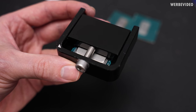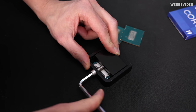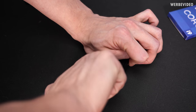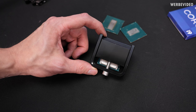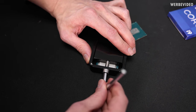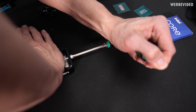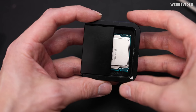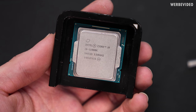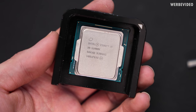The good part is we can still see the components from above — not perfectly but enough to judge if we're touching anything. Just subjectively speaking you need a lot more force than with the previous generation, probably because of the larger die requiring more surface contact. We needed much more force than expected so we upgraded the tools. The IHS moved, so we opened it up to inspect. We're really on the edge on the bottom — can't move the IHS any further without damaging those parts. On the bottom right it still looks okay, so we'll move the IHS back and repeat this about 10 times to try metal fatigue.